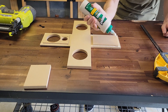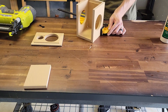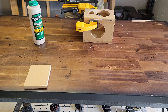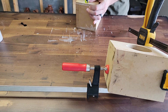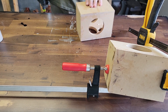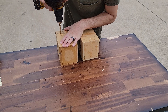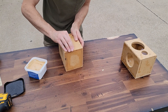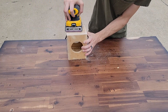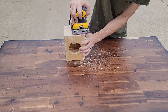Now we're ready to start our glue-up. We're going to use a ton of glue on all our joints and fold the cabinet together. You could clamp and leave it to set up, but personally I'm going to both clamp and use some brad nails — about a one-inch small gauge nail. You've got to be brave to shoot into this half-inch material, but if you take your time and keep the nail straight you shouldn't have any issues. Then it's time to drill binding post holes and fill brad holes with plastic wood before sanding everything flat.